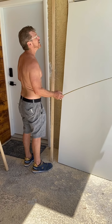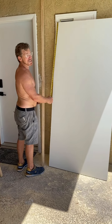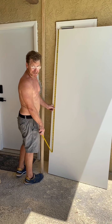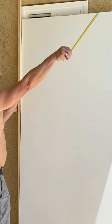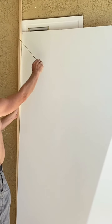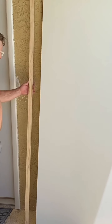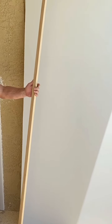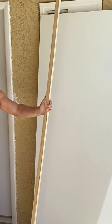So this is cut to shape, cut to size, down from a 4x8 sheet that we brought over from the Home Improvement Center. Make it all equidistant all the way around with 45-degree cuts, so it looks like a picture frame. These are just 1x2s. They're clear, there's no knots in them, so they're nice and straight. And they're kiln dried also, so there's no warpage or bending.